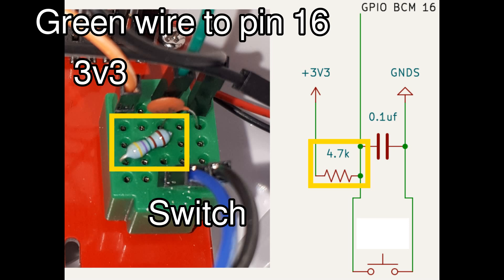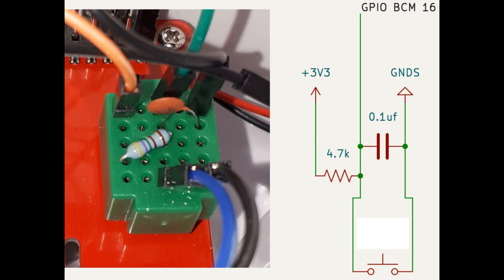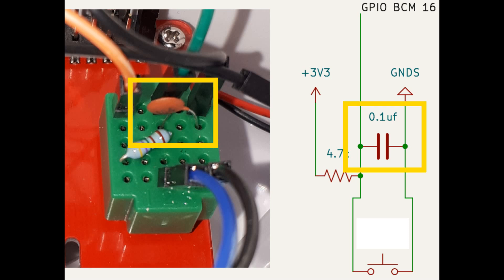When the switch is not pressed, your Pi reads high at 3.3V. When it's pressed, the connection to ground drives your input pin low — the pull-up resistor weakens the 3.3V so the ground signal can easily overwhelm it. There's an extra wrinkle though: the switch will be noisy, bouncing between high and low as it switches. Noise can be reduced with a 0.1µF ceramic capacitor across the input pin and ground. The capacitor evens out power fluctuations, but it's still worth making your Python code wait a few cycles to confirm a genuine change between high and low.